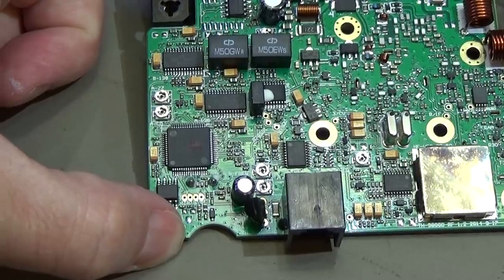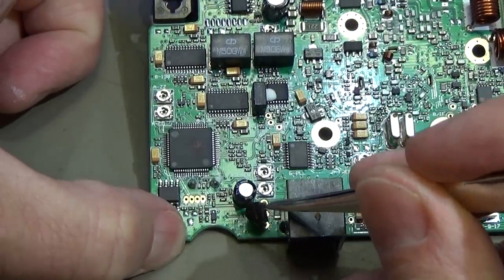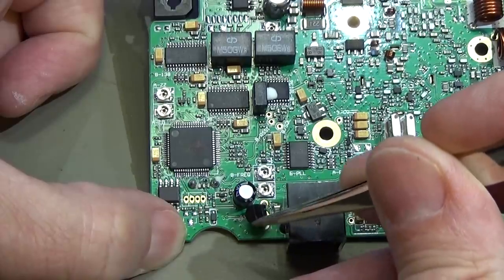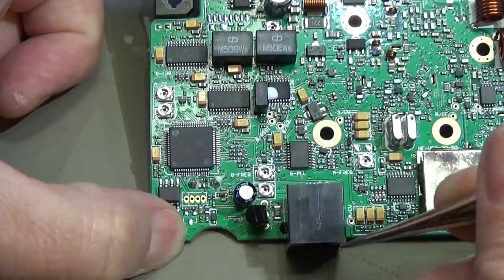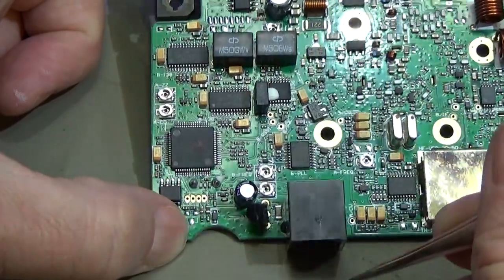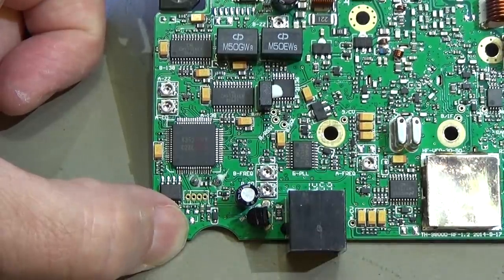Right, so as next step, we really take out this regulator, and let's see if this regulator, if it is really broken, which I believe, is causing our 100 milliamps. So let's see when I take it out, and still we need to find where the trace is to our connector from FB, right? So that is important. But first, let's take it out and see what's going on there.